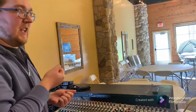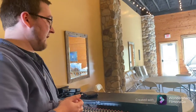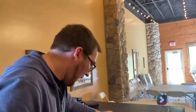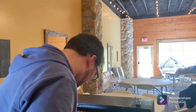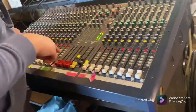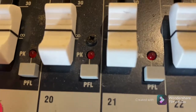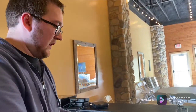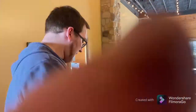If you have a loud singer, you want to take in less signal because there's already plenty. If someone's whispering quietly, you turn the gain knob up to get more balance. You can monitor how much signal you're taking in using the PFL buttons — pre-fader listen. PFL monitors the signal level before it hits the fader, using the level meters on the board. Each channel strip has its own PFL button.